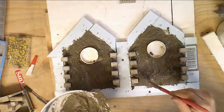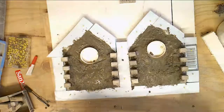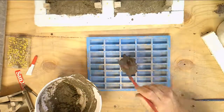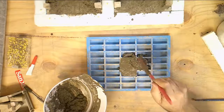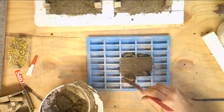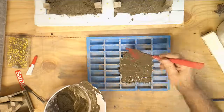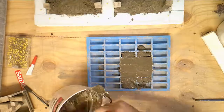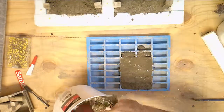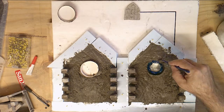The first time you ever cast, you may want to use regular concrete until you get used to the process. Actually, I don't think this was the quick concrete — this was a new kind I was trying out, just a regular professional mix, so it did not set up very fast. I always try to keep a mold handy when I pour because I always seem to make up too much concrete and I don't like to waste it. So when I have leftovers I put them in the mold and make blocks — 10 to 15 blocks each time. It is a win-win: very little waste, and I'm making blocks as I go.